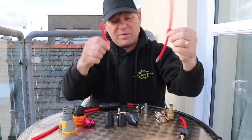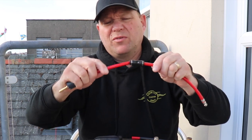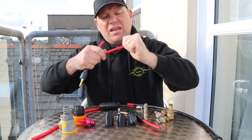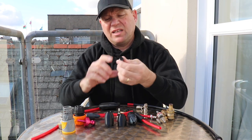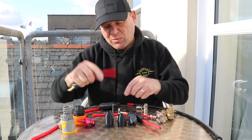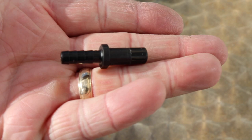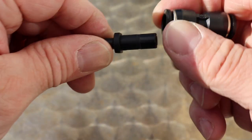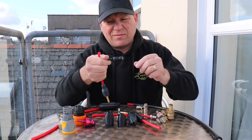If you just want to join two straight pieces of hose together, you have these little John Guest straight fittings. You push them in from either end and they're absolutely solid. A lot of people don't trust these but I'm trusting them more and more. To remove the hose, just pull the sleeve at the top and you can pull them out. Sometimes the Exceed Innovations pipe works really well with John Guest fittings, but for hose that isn't as stiff, you need a little sleeve — you put that onto your hose first, then the black end fits into the John Guest perfectly.